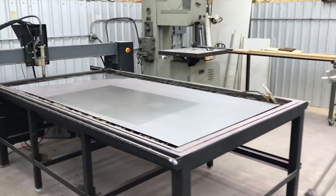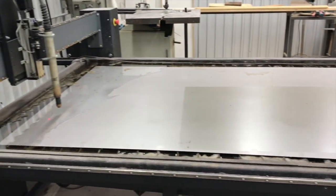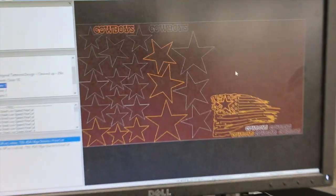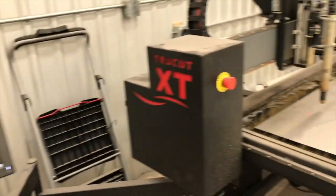Hey, what's up guys? It's Saturday morning here at the Ramsey Custom Shop and I've got a sheet on the table and about to cut out pretty much about three quarters of this sheet worth. I'm going to cut all these stars out at 600 inches a minute with an 85 amp tip.